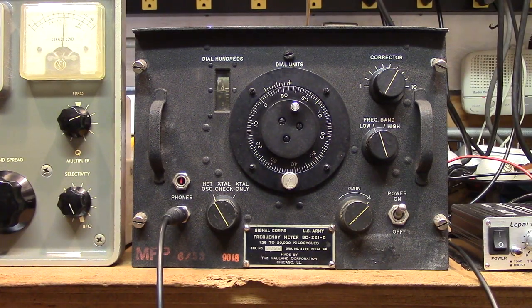I'm not sure every module will fit every one of these models — there may be some custom work to be done. But the modules work on at least two different models that I've tried. This is running on 24 volts and it's pulling only six milliamps, very low drain. So you could run it on batteries. I think he wants to run it on three nine-volt batteries — that'll give him 27 volts and it should work just fine.